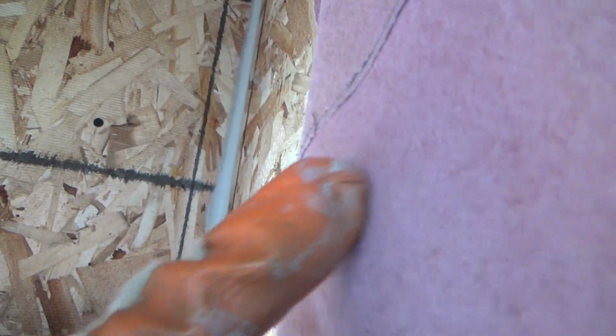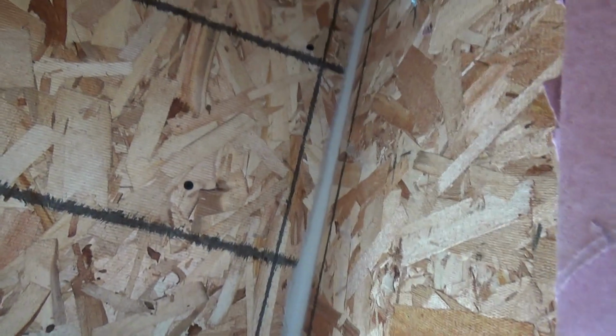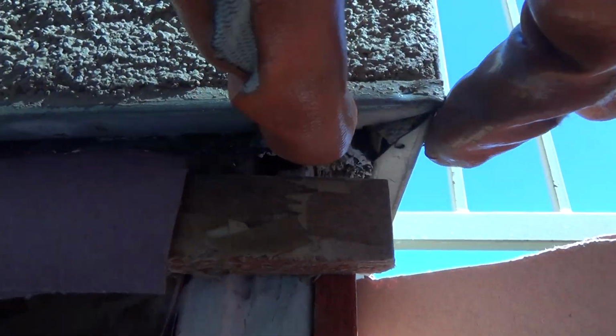And then once I get a couple screws in it, maybe 3 screws, boom, boom, boom, I'll have to use 2-inch screws on that because this is only 1/2 inch, right? And 1.5 inches and 1/2 inch. So 2-inch screws, because I don't want it to break through the paper, because the stucco's just beyond that. See? A layer of stucco thickness there. Man, I had to think a lot about this.